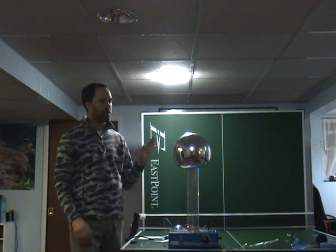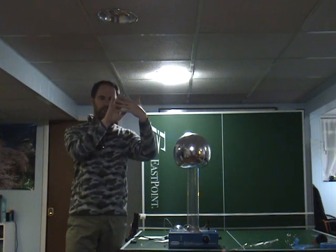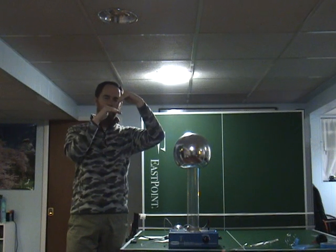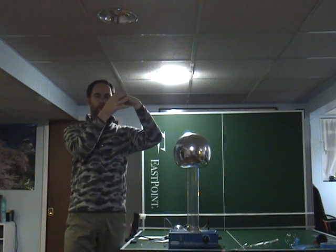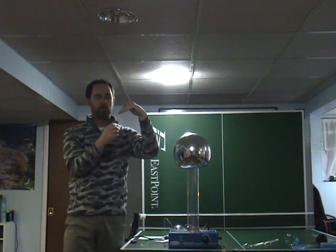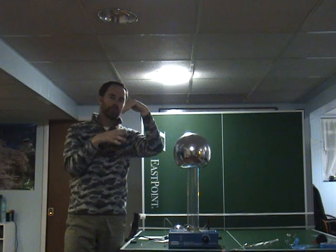When it arrives at the top, it goes over the roller, but as it passes over the roller, there's a metal comb. It's almost like little metal fingers that reach down, I would say about half a centimeter away from the belt. So as the belt comes up over the top, the belt begins to draw electrons off of the metal comb because it's a good conductor. So it starts drawing charge from the entire dome and neutralizes the belt. So the belt that's on the downward side is actually neutral.